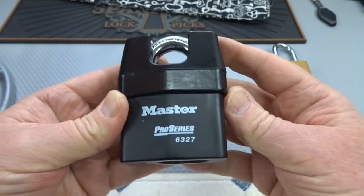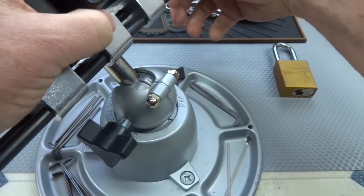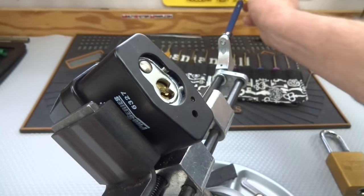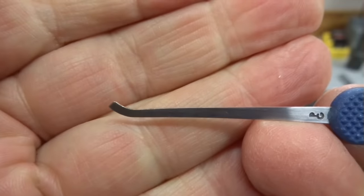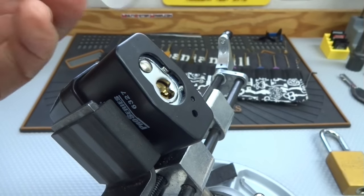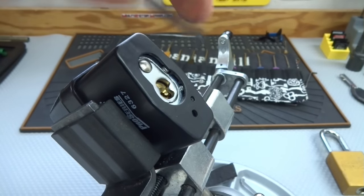I do not have a key for this. It was sent to me by Justin Terrell from Russellville, Arkansas, and it did not come with a key. But we don't need no stinking keys around here. For this lock, the pick of choice is a medium hook — this is a gem, which is the equivalent of a medium hook. Counting five pins, I'm going to use top of the keyway and the long end because this is inset and I don't want it at a weird angle where it would fall out.